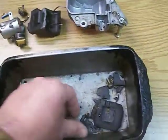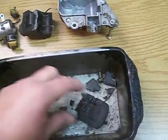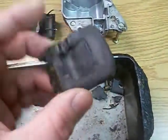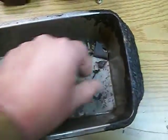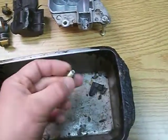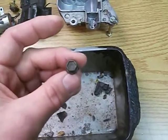Here's where the electricity comes in — I might try to utilize this, possibly. I have an idea that I haven't introduced yet but I'll let you guys know shortly. Here's all the parts and this is all that's left. What killed this one is this wire goes to the pickup coil, and the moisture got inside of there and just ate the wire out. It turned green and looks like it broke the connection somewhere.